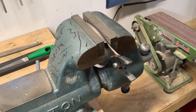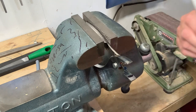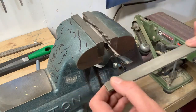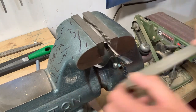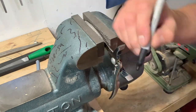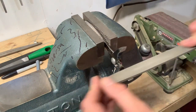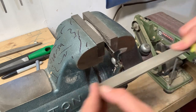This is a trick from knife sharpening: you can mark the area you want to remove with a marker and then file that away, so you know you're filing in the right place. I want to take more off the back side, so I'll mark that with a Sharpie or permanent marker and just make sure I'm filing on that. That way you can tell where you're actually filing. I'll do that to the other side as well — I knew both back sides of my jaws had to come down a hair. File until the marker's gone.